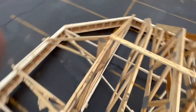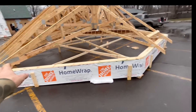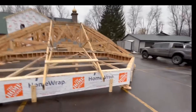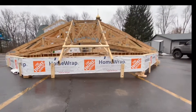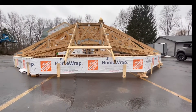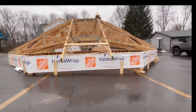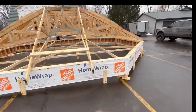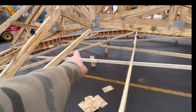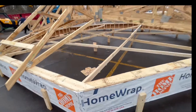Just thought I'd share what we have going on. In order to build this in the parking lot, I had to laser it all in to get it level. You can see the grade there — it'd be pretty impossible to try to frame this thing on uneven ground and then expect it to ever be right in the air, so we have to start level. There's also a ton of bracing in here where I kept the lengths and the diagonals, so this thing will hold true while we put the roof together on it.